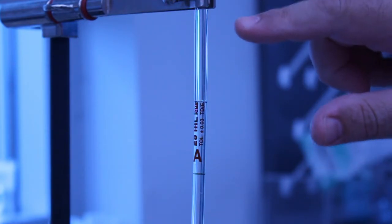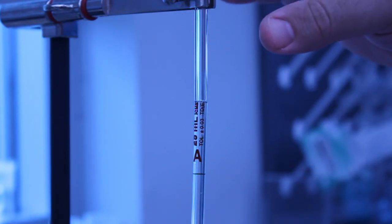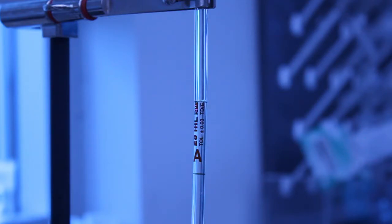I've loosened the clamp on the top, so that this glass tubing is essentially falling downwards towards the body. That should help fuse them together. If I had the top tubing very tightly secured, when I start to heat this, they're not going to fuse together. They're going to actually move apart from each other. So that's something that, if I can, I want to minimize. We'll see how that goes.